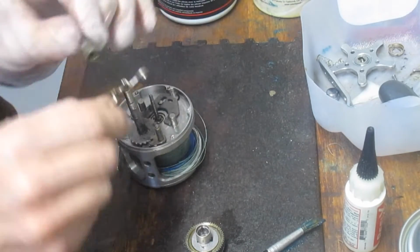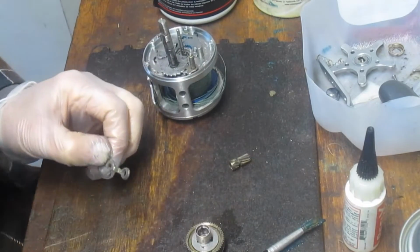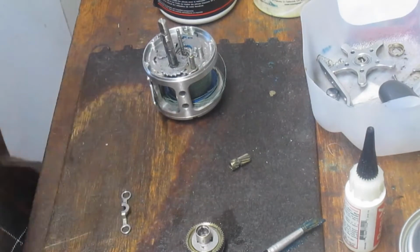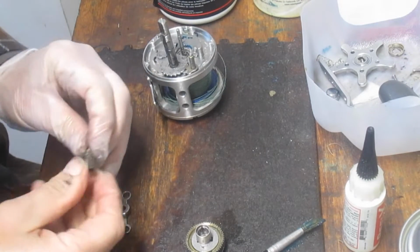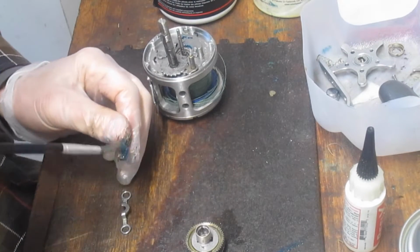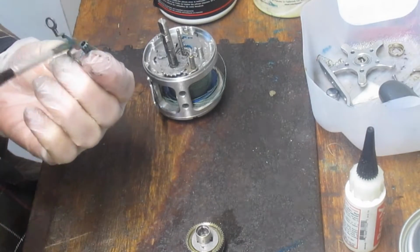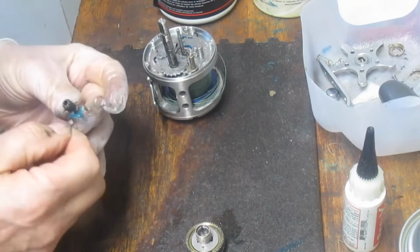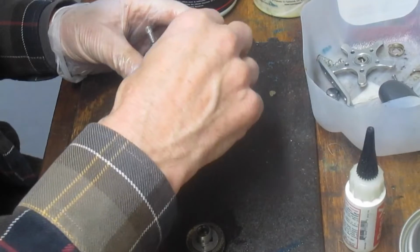Okay, now we're on to the yoke mechanism. Just want to clean that off as well. Clean off the spool gear. Check the spool gear's teeth. Make sure that they're all symmetrical, that there are no bends in them or broken teeth or the like. Do the same thing here with the greasing of this then. Then we can reseat this. Pay attention to the way it came off.